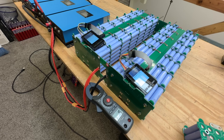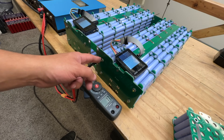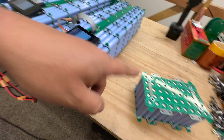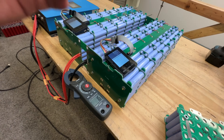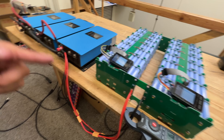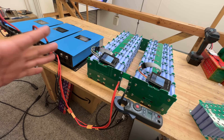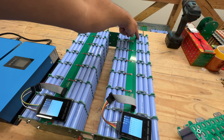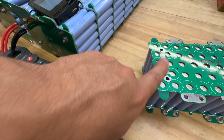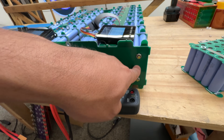This is how I'm envisioning this battery, because everybody needs a 48-volt system — that's what is popular and works with all the inverters. These are compressed already and torqued. There's nothing connecting one module to the next other than these exposed little pieces of nickel in between each module. What I'm going to do is load it up today. The target for this battery is 100 amps. We're also using a PCB over here to transfer from this side to that side using the same compression method.